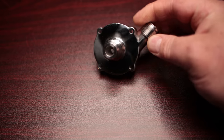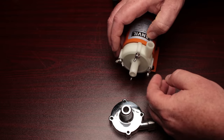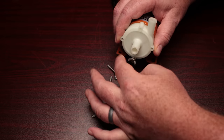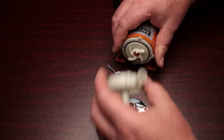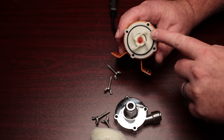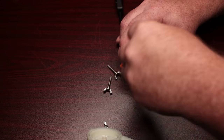It's really simple to replace. Basically, take the nylon pump head off — leave the nylon base on the pump itself, leave the impeller intact — and then just replace the nylon pump head with the stainless steel pump head. One thing you want to make sure: don't lose the red thrust washer; a lot of people lose those. Tighten everything down and make sure the O-ring is around the nylon base before you put the stainless steel head on — if it's still in the nylon head, you're going to have a leak.